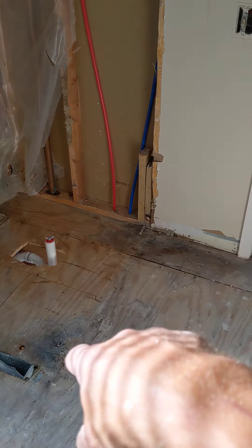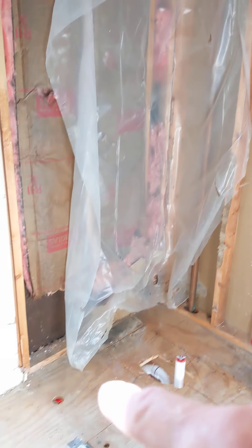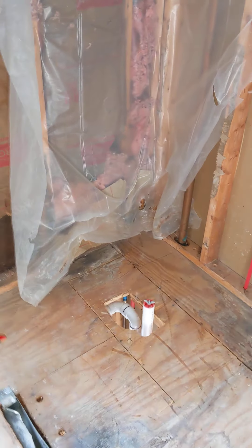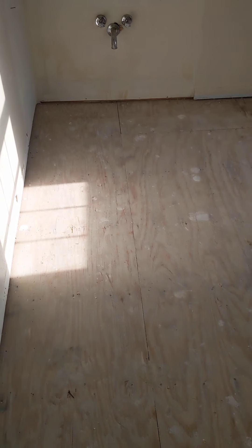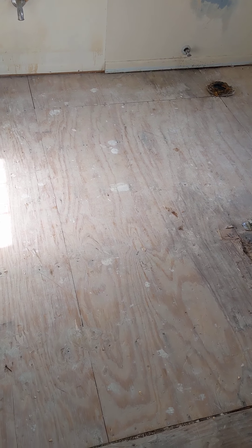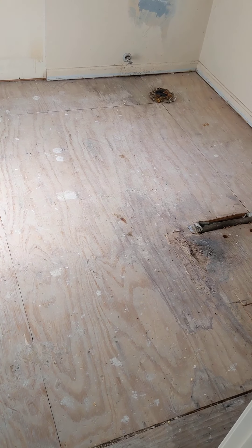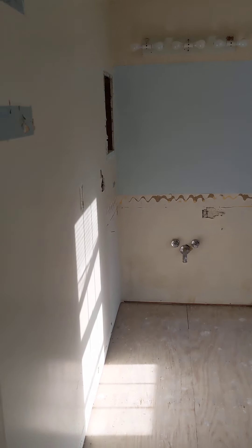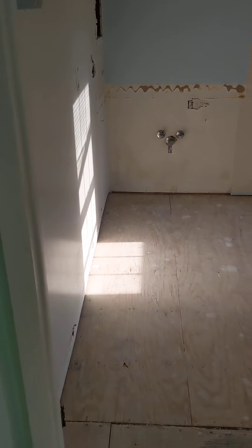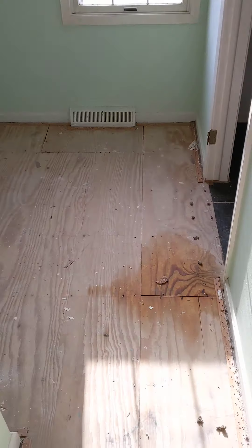This will be a shower pan, a little bigger than the one that was there, with tile on the wall all the way to the ceiling, tempered glass with a curb. We'll have a membrane on it to protect the floor below. Part of the job on the second floor is that all this plywood we're going to screw down — it squeaks like crazy from expansion and contraction of the house. We'll go through the whole place and put hundreds and hundreds of screws everywhere, otherwise you'll hear that sound all the time.